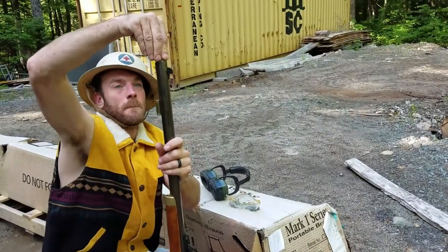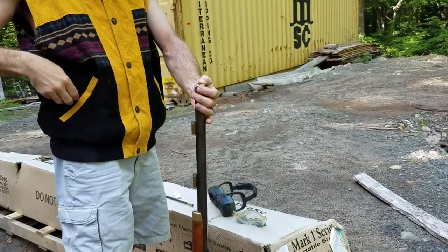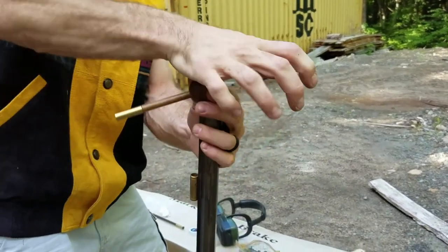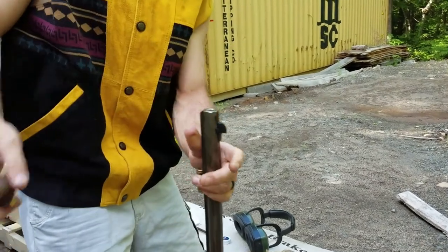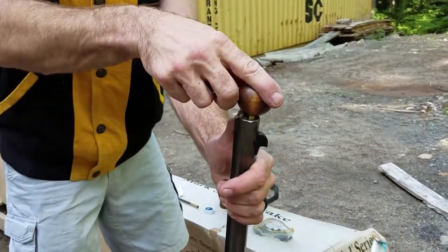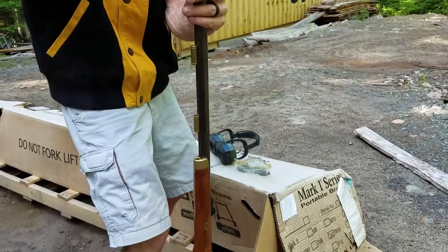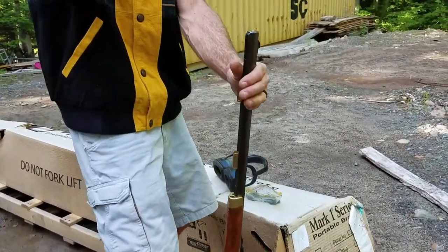Keep everything well lubricated. Put that in the top. Then take this fancy little guy, and you start with that end. Put it like that and give it a tap. It's always very tight. You can see — never look directly on there — it's just inside there, as deep as that goes. Then you flip it over and you use that end. I'm kind of on my shoe so I don't mess up the bottom of the gun. I like this gun. And you drive it in that far. Now you're done with that guy.